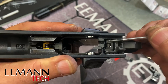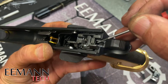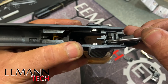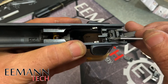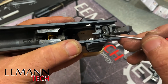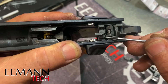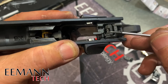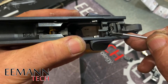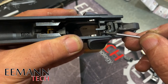To explain what goes on: this is your sear, and this is the part of the sear that holds onto the hammer hooks, right there. This leg of the sear is what is prevented from going down — allowing the sear to disengage from the hammer to allow the firearm to fire — by this bearing surface on the safety. That surface is oversized when you buy the safety catches because the tolerances in the trigger group are all different in every gun.